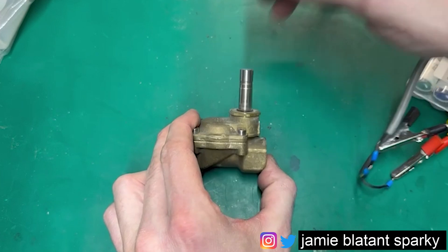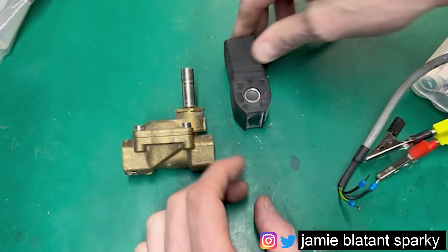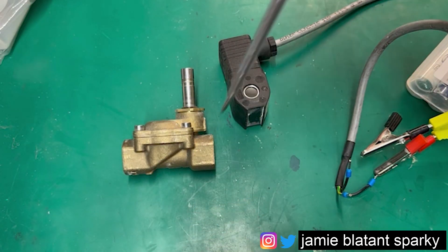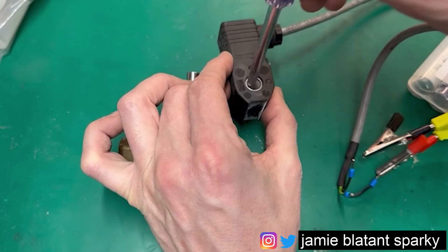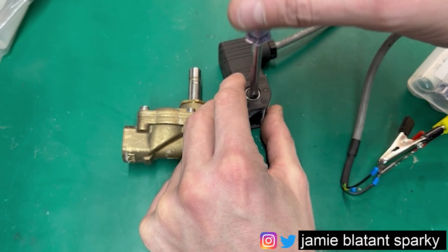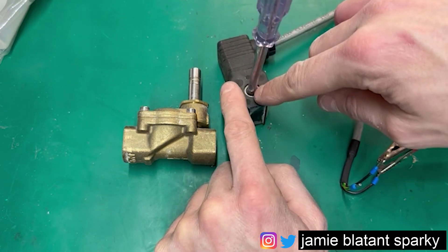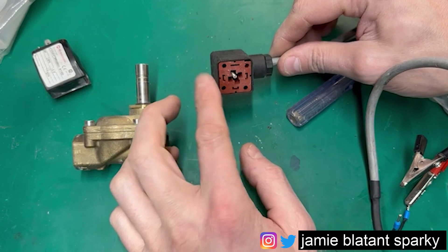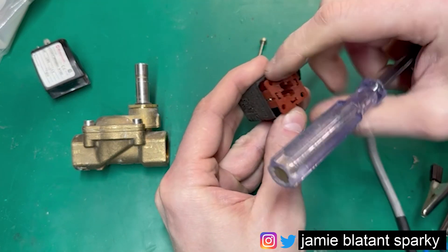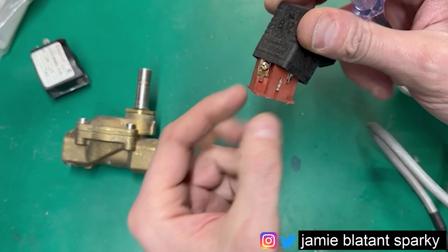Little tip: first, you'll see I've disconnected it. Never leave this energized because it will burn it out. But you can briefly energize it to test it. If you want to test one of these you can get something metal - like this electric screwdriver - put it in there and you'll see it moves around quite a lot. Energize it up and I can feel the resistance in there - that's working. But never energize a coil without something in there to act on the magnetic field, otherwise it will get really hot and melt. One of the big problems with this type of plug is testing it, because you have to pull this out and drag this out, and then you can just about get to the pins - which is an absolute pain. Or you leave the top off with it all exposed at mains voltage, and you're going to really hurt yourself.